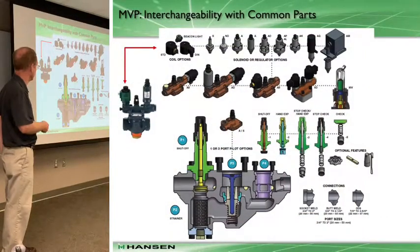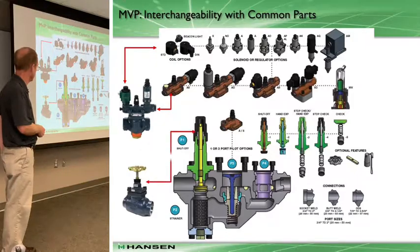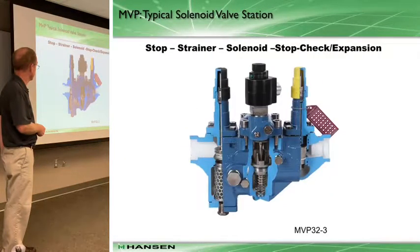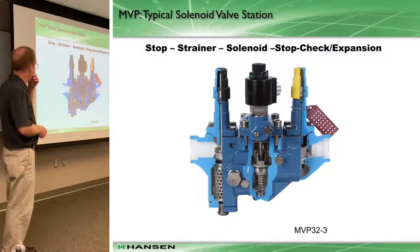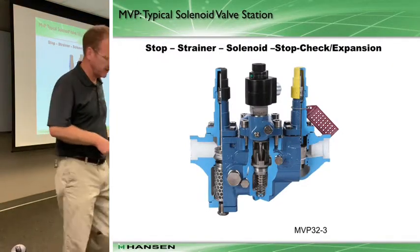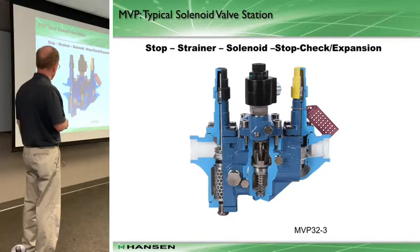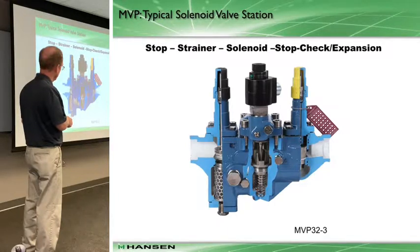It's a nice migration — it reduces space for quicker pump-down, eliminates the flange gaskets, and parts are still interchangeable. From the outside you can clearly identify each position: position one is always a shut-off valve, position two always a strainer housing, position three is always the control valve — the top may vary, sometimes a pressure regulator, sometimes a motorized valve. This fourth position varies based on application and can be a simple shut-off valve.